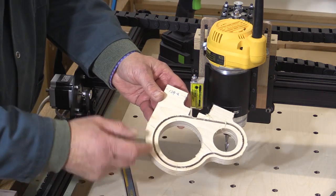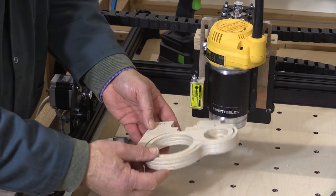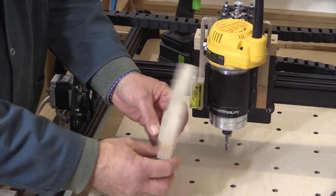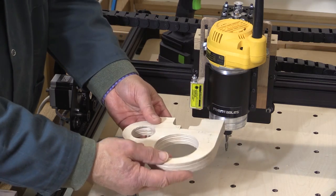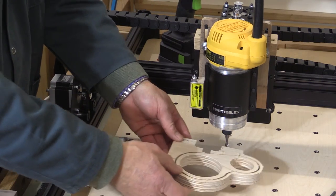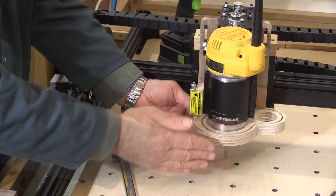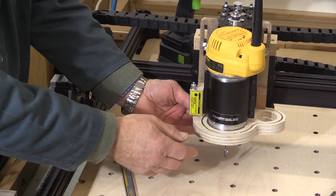And here I have my opportunity to point out one of my blunders. I designed this and thought it looked really good on the computer screen. I put in the channel where the bristle was going to go — but guess what? The bristle channel is on the wrong side. It should be underneath here, so the one I'm actually going to make is a mirror image of this, and it will have its bristle channel on this side. When it's put the right way up, it will be spot on. You can probably see there's a small gap around here, which allows the router to move freely up and down along the Z-axis as required, without the dust boot itself getting in the way.